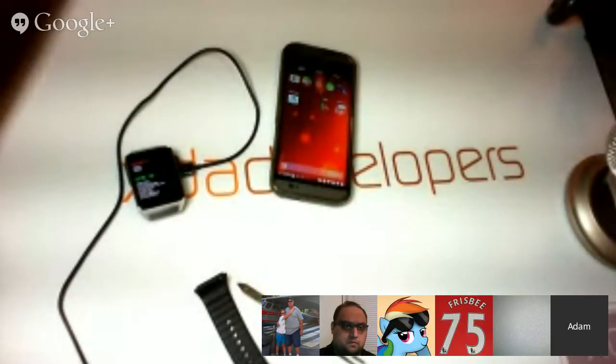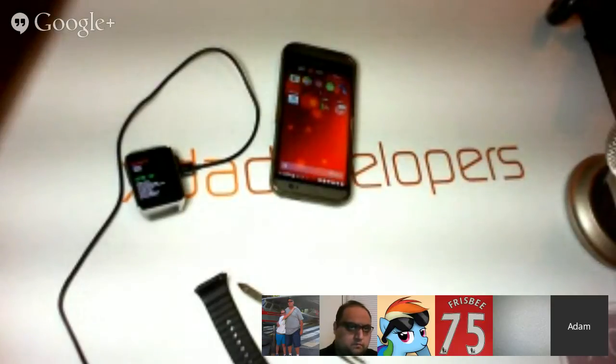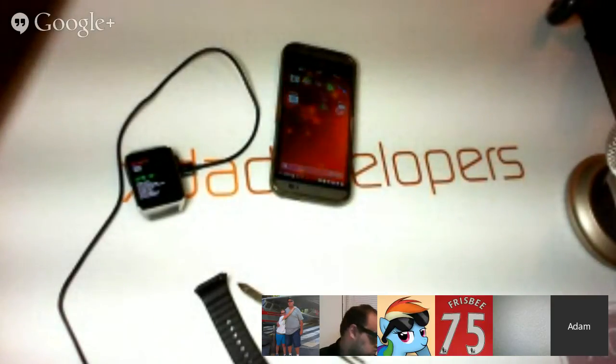Okay. I'm going to look something up really quick on XDA Developers from a previous thread. I wrote down some Qualcomm OEM commands for a different device, and I'm going to go reference that. I just have problems remembering these fastboot commands. I just don't use them enough. I usually use them once, and then I'm done with them for a while. Just the fastboot getvar, and tons of things you can do with that. Padphone X root is what I called it. And down near the bottom. All right, so fastboot getvar product.